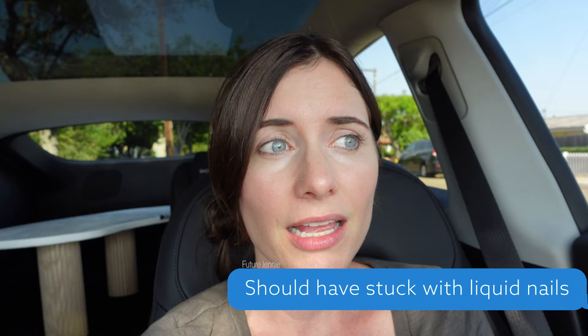After about four hours it finally set up and the table was solid — the tambour material wrapped around the PVC pipes created the legs, and I set the top on with adhesive in between. Everything stayed together when I picked it up, but I'm curious how it holds as I move the table around, because it didn't feel as strong as Liquid Nails. Things I'd change: adjust the adhesive, definitely route that edge, and work more on getting a smoother concrete finish with the troweling and sanding. But I love the way it looks — I'm so into organic shapes right now, and with kids, it's even better because there are no sharp square edges.